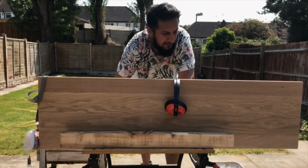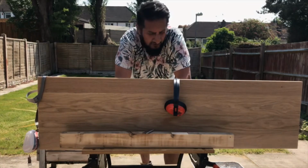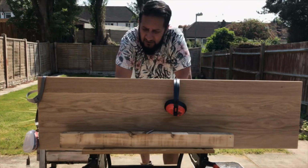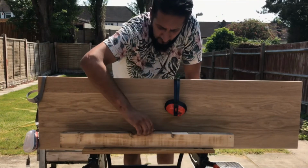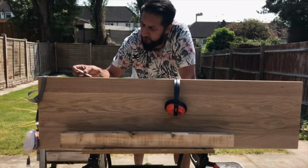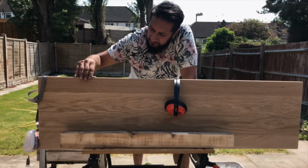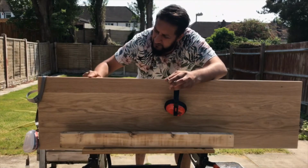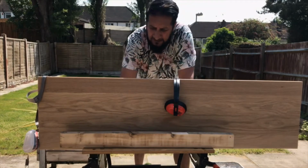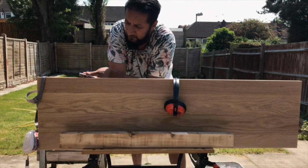And now I think I'm going to put Danish oil on this, guys. But the next thing now is, guys, these are the tops, and remember they're going to be foldable. So I've got the hinges here. We now need to set the hinges in. I think they're about 2 mil thick, so we need to obviously recess out either end. And yeah, so these fit nice and flush.